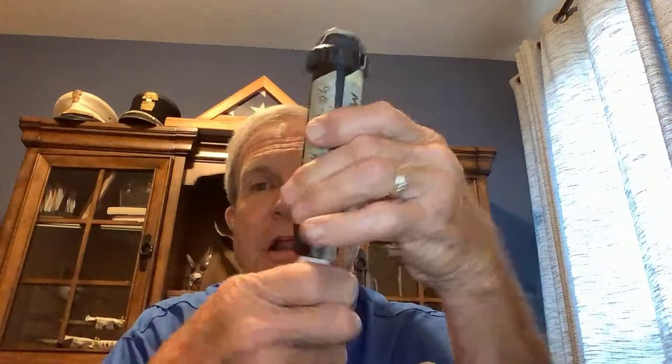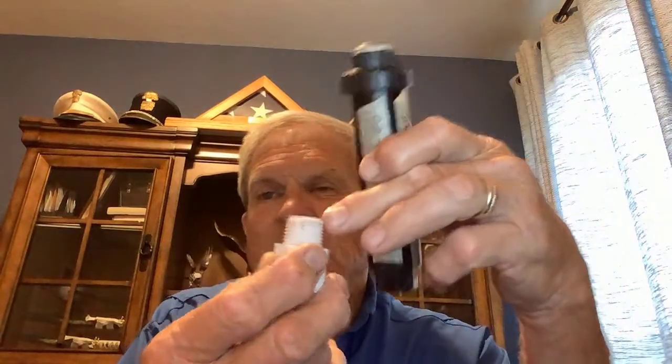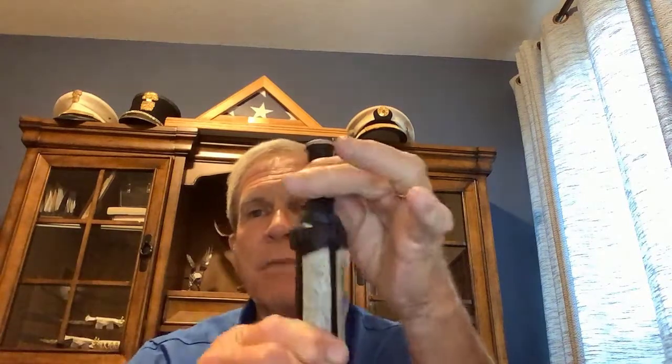Once again, underground, you're probably going to have some PVC piping run over it, and then a T coming up. And this could be the T right here, and it'll have a male or a female fitting on the end of it. This will be about maybe 6 inches under the ground, about the length of the pop-up head. So this head just screws into it, just like that. And then when the motorized valve opens up and the water's flowing, the water pressure pushes it here and allows the head to pop up out of the ground, and then it sprays the water.